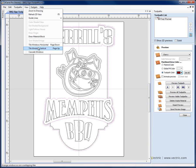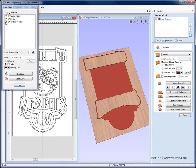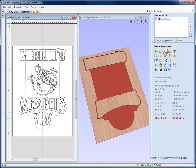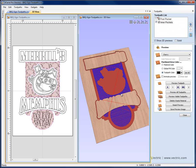I'm going to tile the windows vertically so we can see both views and bring up the layer manager again. This time I want to switch on the pocket layer and switch off the outline layer. I want to pocket between the internal shapes to machine this area out, and also select the offset outline around the pig. With those five vectors selected, I'll come back to the pocket menu, start at 0.25 because we've already machined that away, and come down another 0.25 of an inch — so the new total depth of cut will be 0.5. I'll call this 'inner pockets', calculate that, and assign it a brown colour.